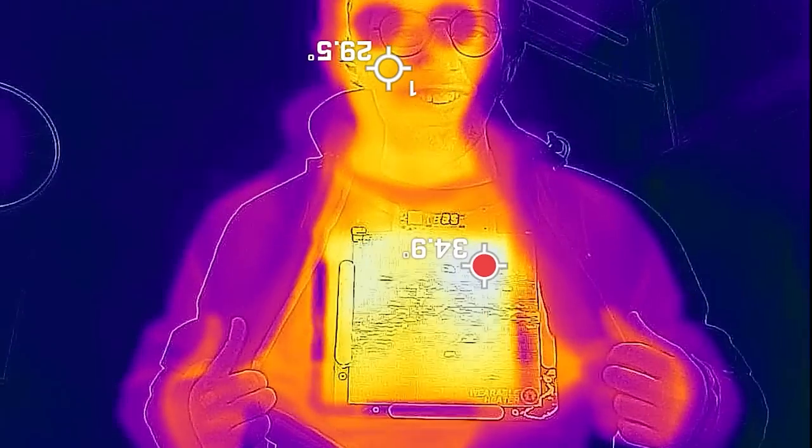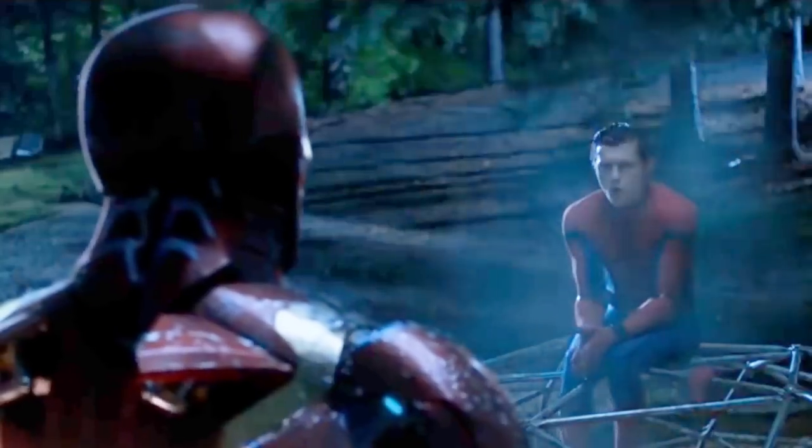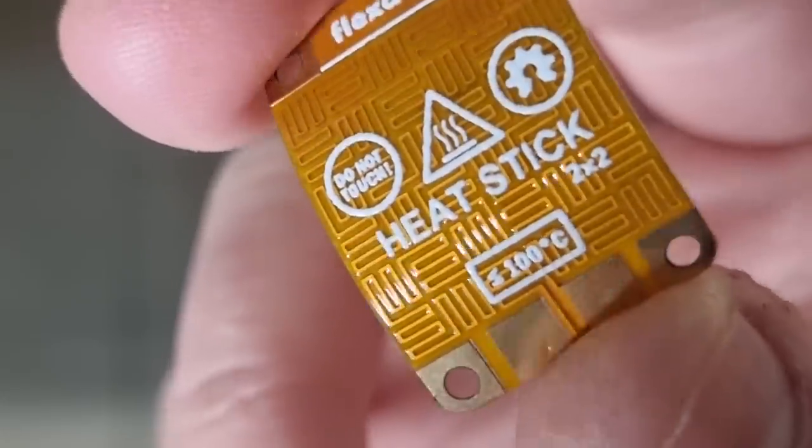Today we're going to make a wearable PCB heater, which is inspired by a startup. I put everything in your suit, including this heater. To make this happen, we need a heater that is thin and flexible. It will heat itself up by integrating a super long copper track inside a flexible PCB.